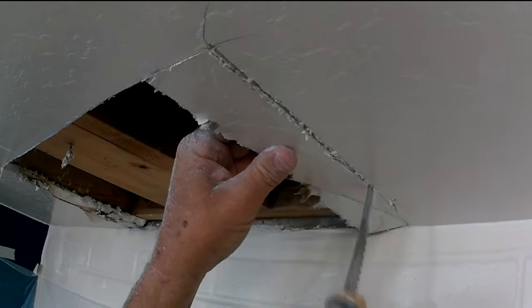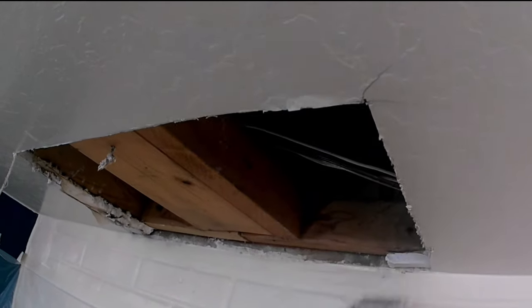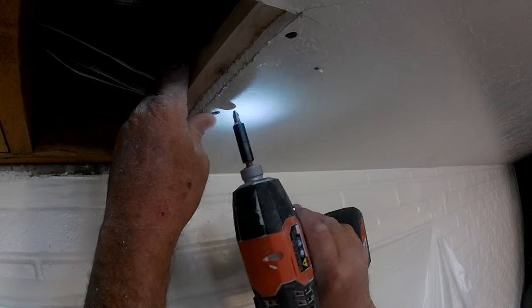If you had to do some drywall in your house and you're not comfortable patching or doing mudding and texturing, the easiest thing you can do to save some money is just square up the area — one by one, two by two, four by four, just a nice square patch. Then when you start calling around getting estimates, you'd be surprised: just by having the area nice and squared up and ready for sheetrock, you can save some money on your project. You can simply say 'I just need to get this two by two patch patched in' and send a picture to get a basic price.